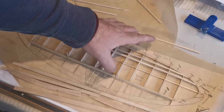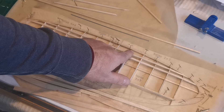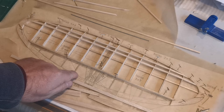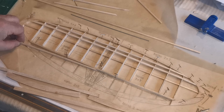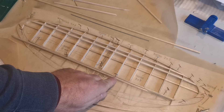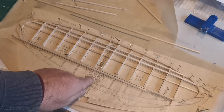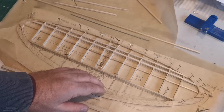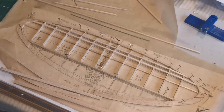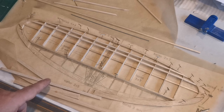That didn't take very long at all — the basis of the horizontal stabilizer is now completed. The upper spars have been added; they're quite lightweight, but that's fine as we need to keep the weight down at the back. Now to build up the rear elevators — here are the parts, obviously needing to be cut to length. I'll pack between them, perhaps using pins to keep a slight gap when making them. They'll have to be shaped to allow the elevator to move. The provision shown to locate the tail surface with rubber bands won't be used — it'll be permanently fixed to the fuselage, so I'm altering the design slightly.